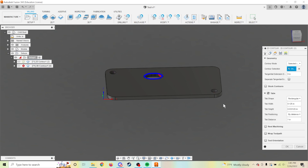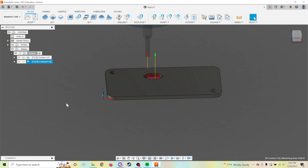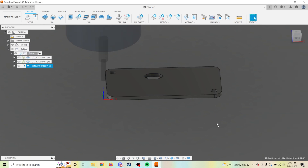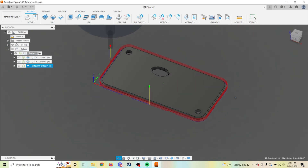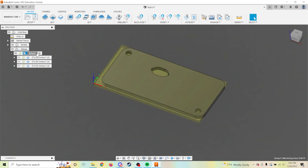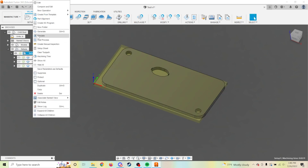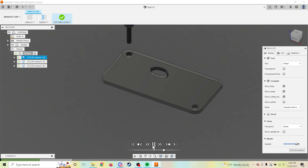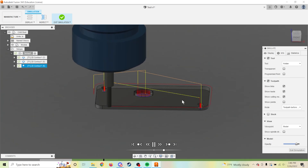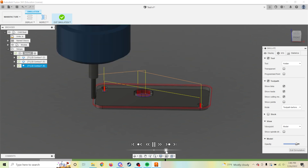We repeat this process, selecting screw holes first, small interior cuts second, and the exterior cut last. This drastically reduces the aluminum chatter, resulting in a smoother and more polished final cut. Once we've specified our settings and selected the contours, we simulate the cut. This is a great way of checking whether or not the cut will be a success, and manufacturing details are important, so it definitely pays off to be careful.